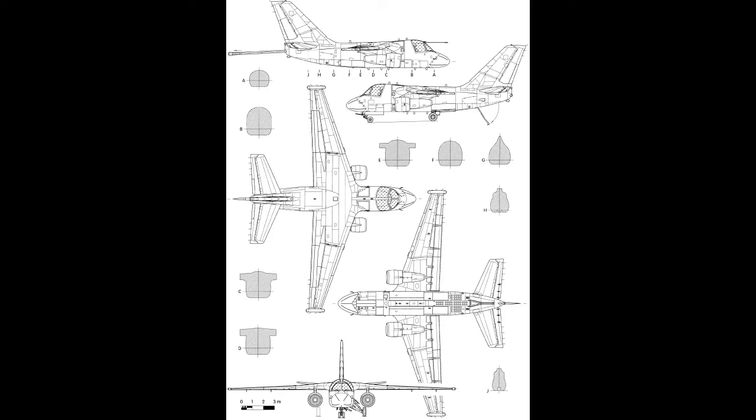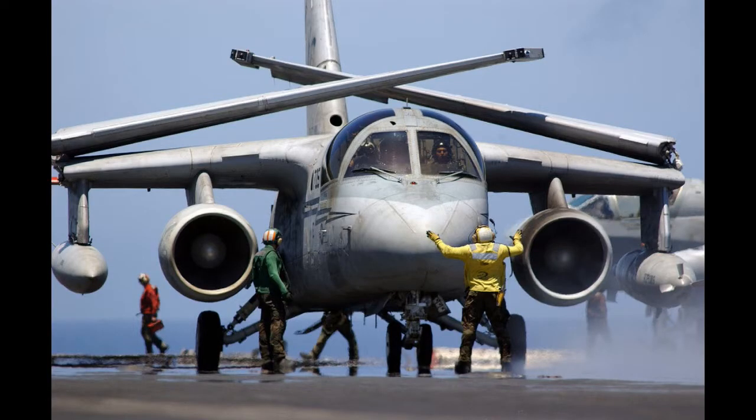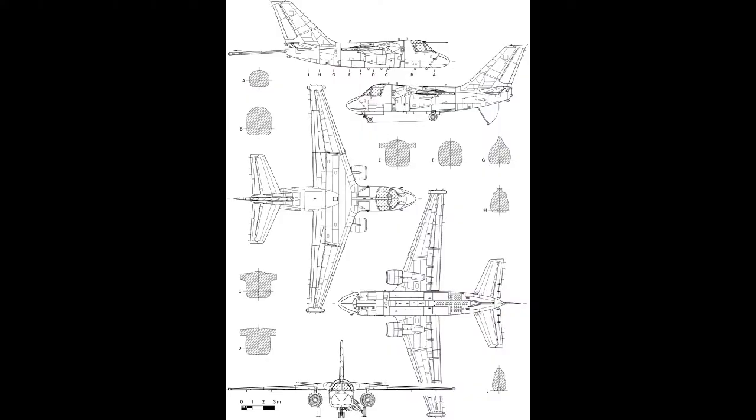From the beginning, we knew that the biggest problem we would face would be the landing gear. The S-3's main landing gear has a very wide stance with huge oleo struts intended to handle landing loads on the carrier. The gear retracts rearward into the gear well. We needed a pneumatically actuated 1/9 scale gear implementation, and, of course, it was not commercially available. So we decided to make it.